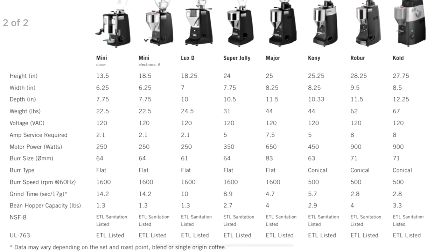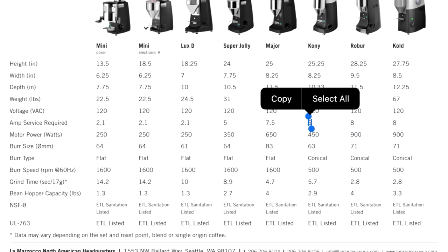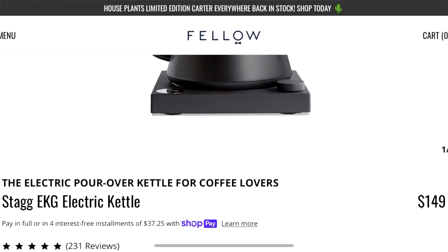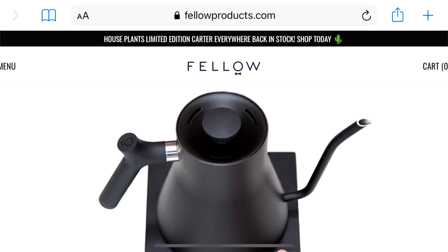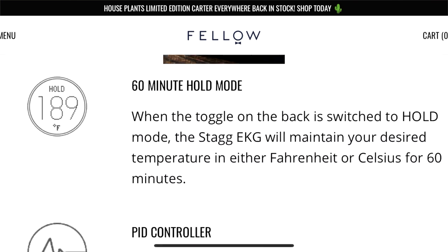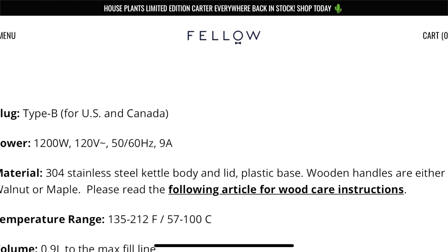The second generator is where you connect everything else. For my setup I have a Mazzer by La Marzocco grinder which uses between 5 to 7 amps — some grinders use more, some less. I also have a Fellow Stagg kettle that uses a lot of amperage as well — I believe it uses 9 amps. Any heating element uses a lot of juice, so I suggest you stick to one kettle. That's why I don't recommend combining a pour-over pop-up with an espresso pop-up — too many heating elements.